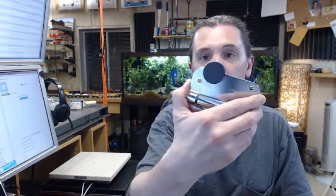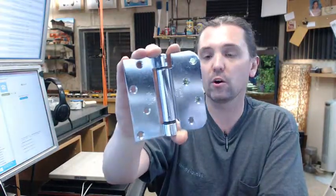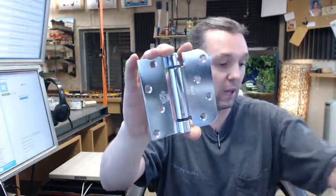And the 603 means that it is a steel base hinge with a zinc coat on it. Zinc plating is a very good corrosion resistant sort of plating to have. It's got a silver finish to it, so it might complement your chrome hardware, and it's corrosion resistant.